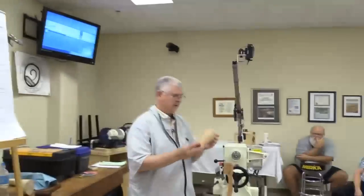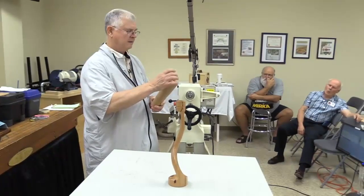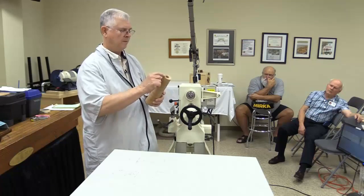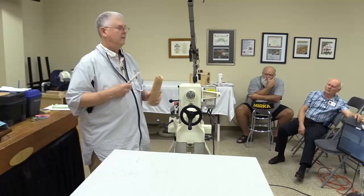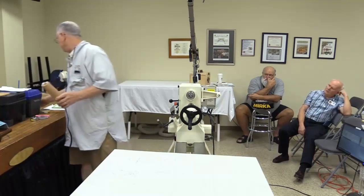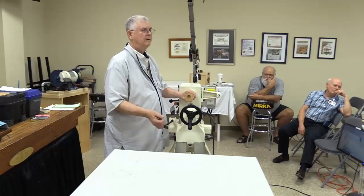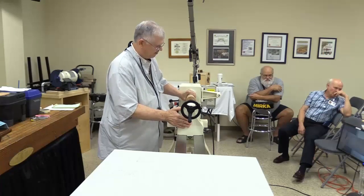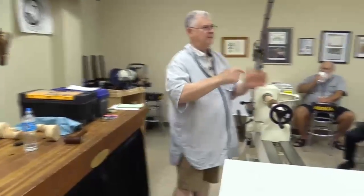Now this is my blank. In the interest of time, I've already done some preparation on it - I've already put my divots in the end of it, I've already put a hole in it where my little logo will go, and I've already put a hole in this end here for where the kettle will fit. You use the forstner bits to make your divots and then just punch it to the center. I used three different sizes of forstner bits and then put it in the chuck and very gently trimmed out the ring so it was tight.